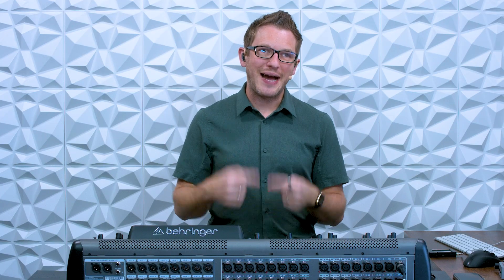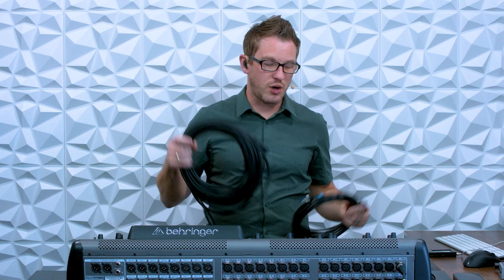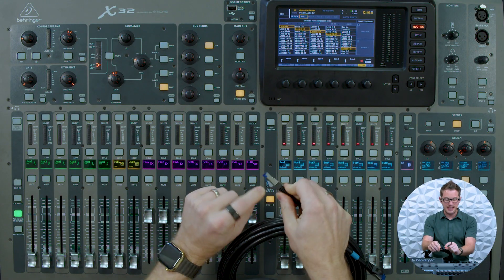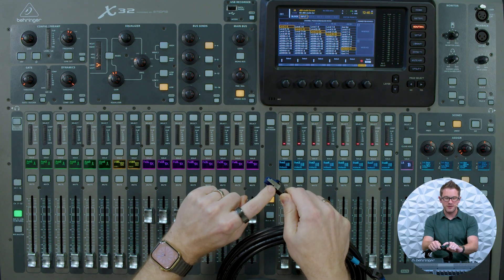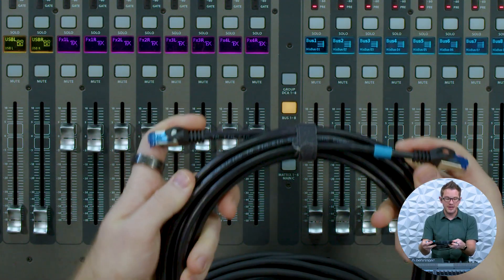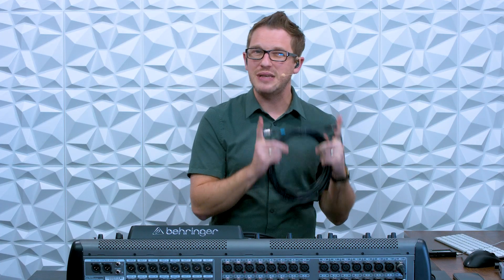When you are adding in these AES 50 devices, you must use the correct cable — this is so important. Please do not use unshielded cable for your AES 50 devices, as this will cause pops, drops, clicks, and total loss of audio on longer runs of CAT cable. Make sure that when you're connecting your AES 50 devices you are using a shielded CAT5E cable. A shielded connector has a metal enclosure around this RJ45, and this shell is connected to the shield that goes down the cable — this is an STP cable, shielded twisted pair. If you're using UTP, that is an unshielded cable and should not be used with AES 50.